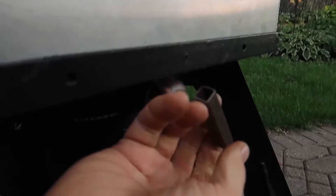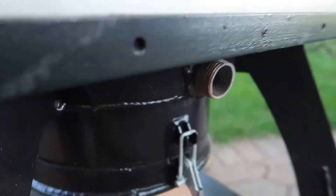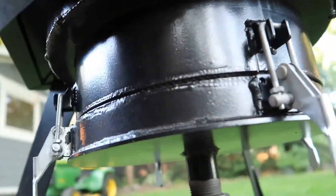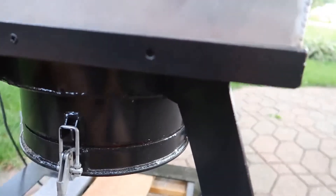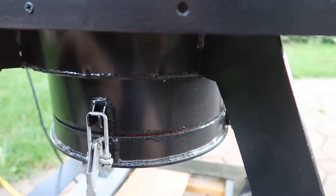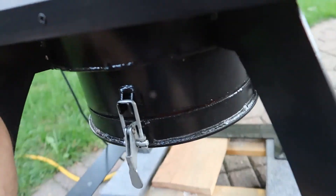Down here on the front of this side we have a lighting port. There's a T-handle here — we put the torch in here to light it up. That goes up to the burn chamber. This other port here is to view the fireball and to poke the char. When you first get started, you need to loosen up the char around the jet — the nozzle — to make sure air flows in that area. It can't be blocked; it needs to be very loose so the air can flow through and you can get it started.